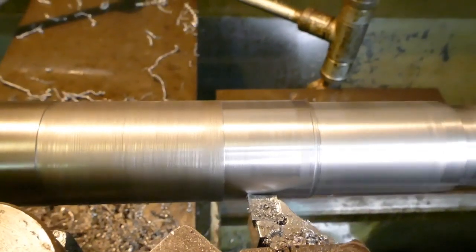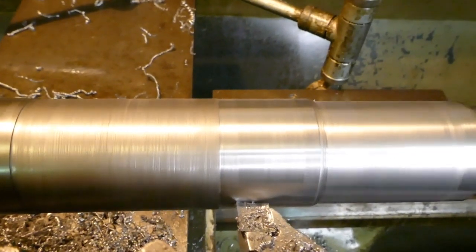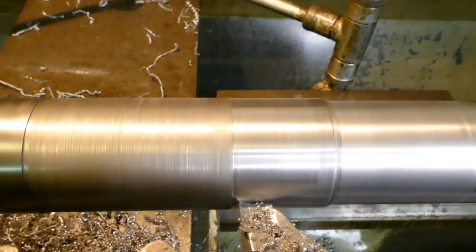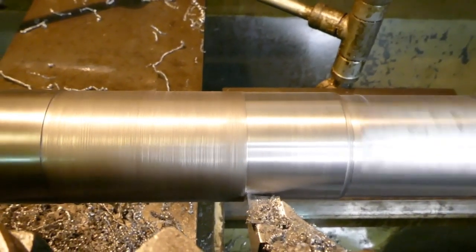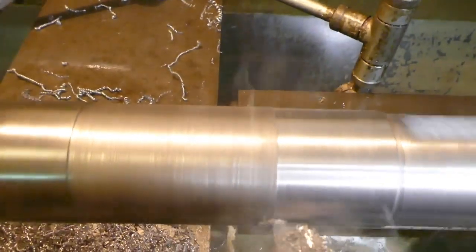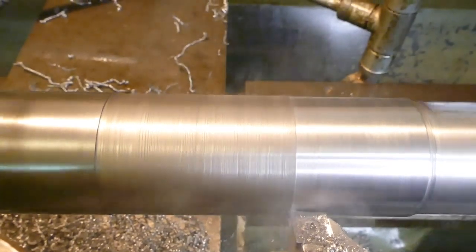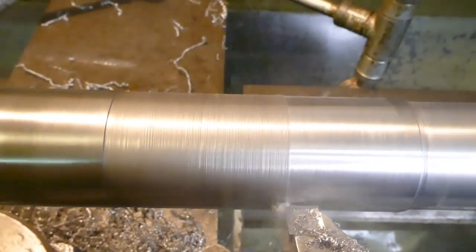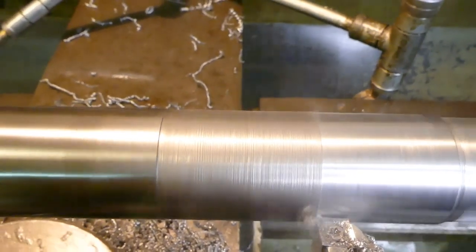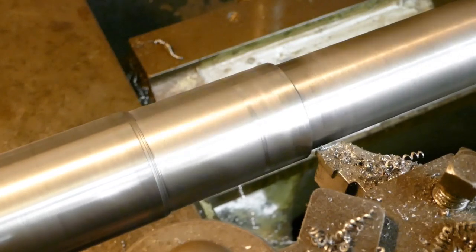Let's take a little spring cut off here — tiny — and then we'll get into cutting some fresh metal. We're going pretty slow on feed, with a sharp tool really meant for aluminium, but an efficient cut. We'll see how far we get. Just touched on twenty thou on the diameter.